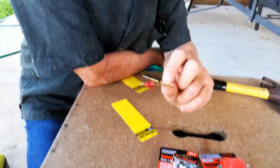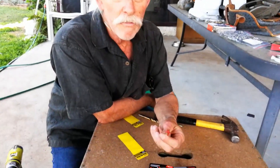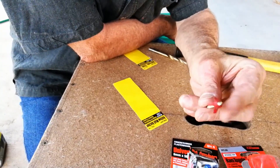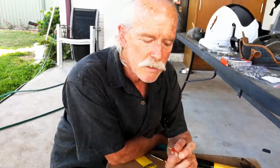One that we didn't test was this — some people call them anchor plugs. I've used thousands of them. They are very easy to use and effective, provided you have the right screw for the job. There are two-start screws and single-start screws and they're different sizes — if you have the right one, they're great. However, I have stopped using them over time because my experience has been that when I go back to jobs that are ten years old, these things have given up. They're great the day you install them, but if you want the equipment you're fixing to still be there in ten or twenty years, don't use anything plastic — that's my advice.